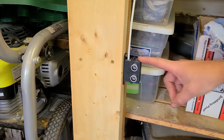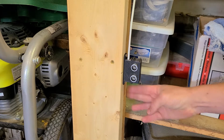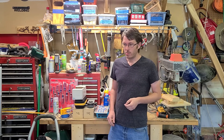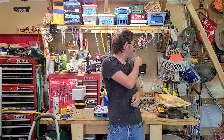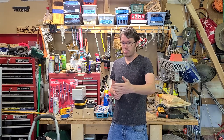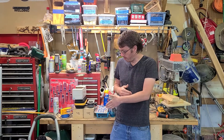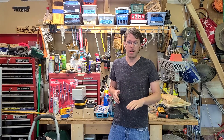This is the ultrasonic distance sensor that measures the distance between the leg of the workbench and the front bumper of the car as it's being pulled in. As soon as the system recognizes the car being pulled into the garage, the green light on the stoplight will come on and the display on the microcontroller will also come on. Once it passes through a threshold of 24 inches, the light will change from green to yellow, and once it passes to about a foot from the leg, it will change to red telling the operator of the car to hit the brake and stop.